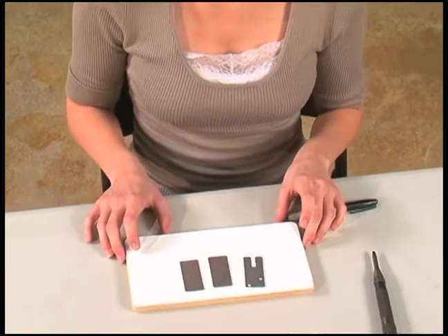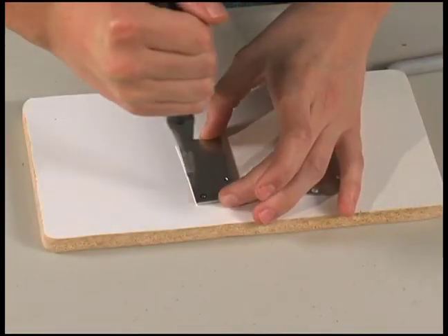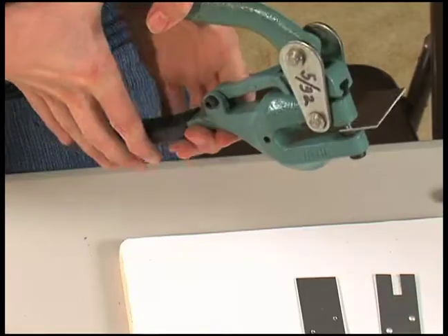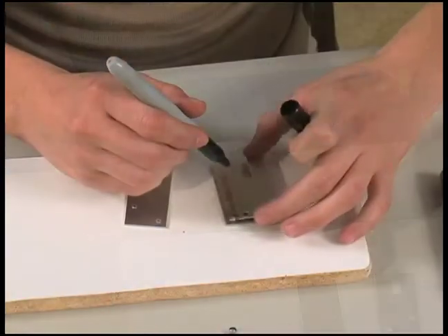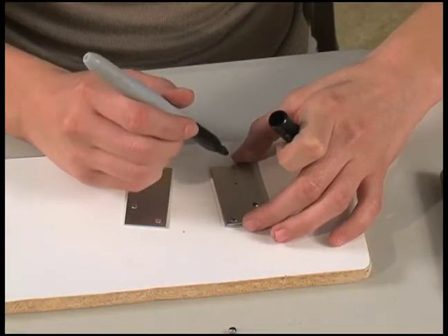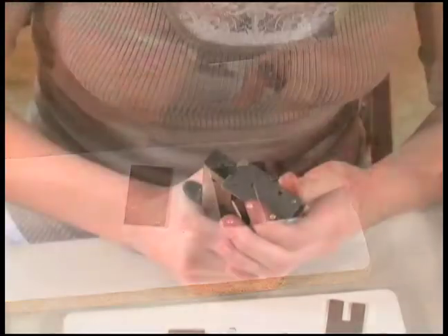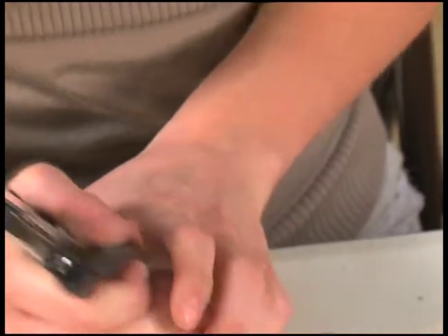To make the solenoid bracket, use the sample and a center punch to mark the solenoid mounting hole locations. Punch out the holes with a 5/32-inch punch, being as accurate as possible because it must fit the solenoid. Follow the sample with a pen to mark the slot. Be sure that it is centered in the nibbler tool and make cuts until the slot is complete. Compare it to the sample.